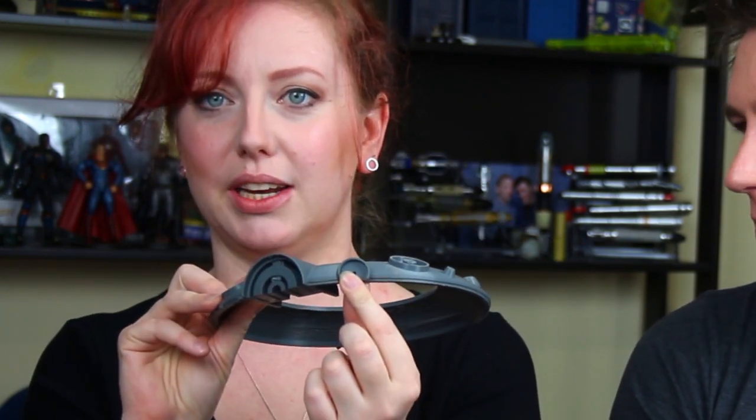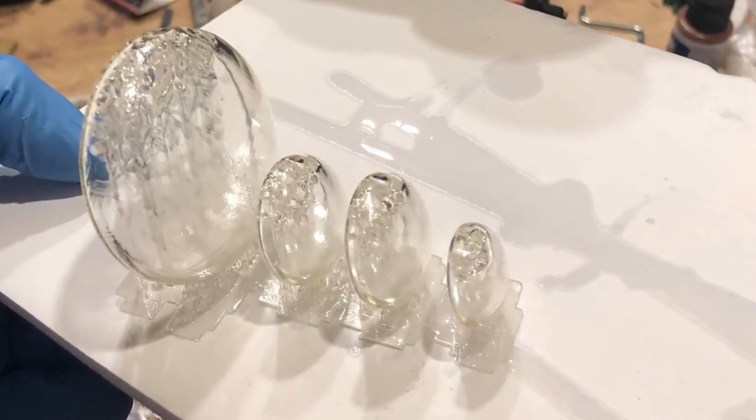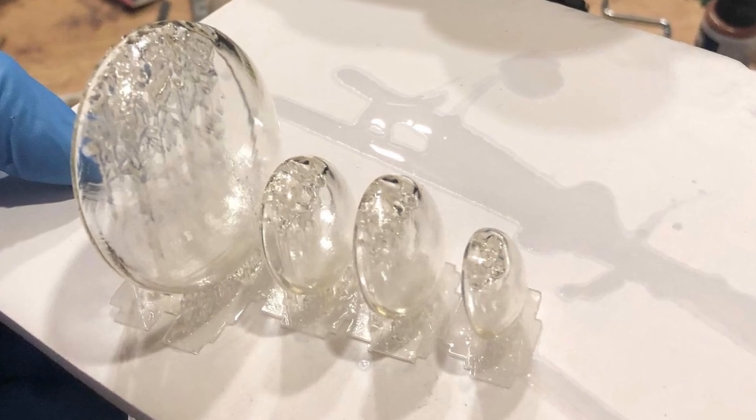I gave Justin the measurements of all the points that would have lenses — this front one here with the bottom to it, both of these up here, and this small one here. He 3D modeled the domes and we resin printed them on the Anycubic printer. Using clear resin was really great because they ended up being almost glassy almost immediately, and after some sanding and prep work you can custom tint them to a different color, giving a truly glass finish rather than the dull look of a solid white print.